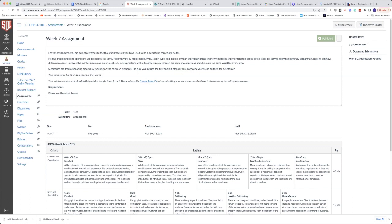When you go to do the bluing, they call it cold bluing because you're not dunking it in a hot tank. However, you want to get that screw head heated. What it does is it opens up the pores of the metal so that it can suck in that bluing, so you get a deeper blue.